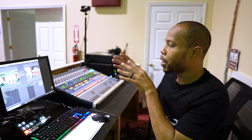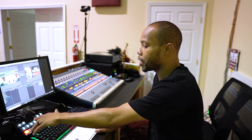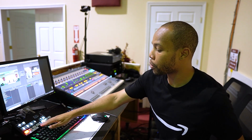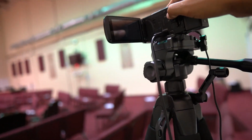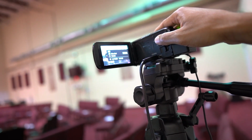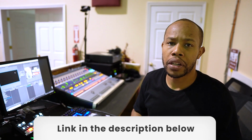What's going on here is I have my OBS set up and the ATEM switcher that I brought in a couple weeks ago and moved over our camera. But the problem that I'm having is right now we have our ATEM set up for camera 1, which is our main, showing just fine, and number 3, our camera over here to the right, also showing just fine. But that secondary camera that used to be our main camera against the back wall is not showing up on input number 2. The current configuration was to run an SDI cable from this location all the way around to where that camera is going to be, because it's quite a long run. I think it's about a 100-foot SDI cable, but I'll link to everything that I'm using in the description.